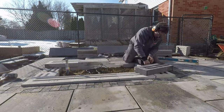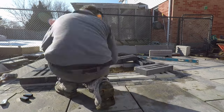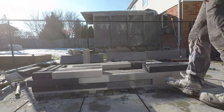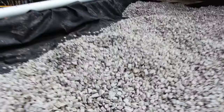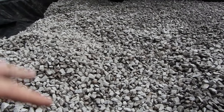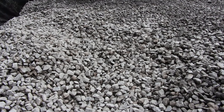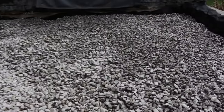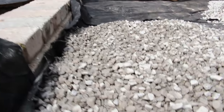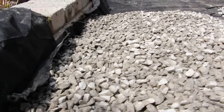I would maybe do steps on paver base panels — I haven't yet, but in the right situation with a backyard patio with less than two steps or 18 inches in height, I would probably opt for paver base panels for those steps. Now, reasons why I would not use paver base panels: if it is a raised patio I'm not going to use them. We'd be using open graded base — we have to build up that patio anyway, and we're very confident with our open graded base installs, so we don't need the added benefit of those synthetic base panels on top.